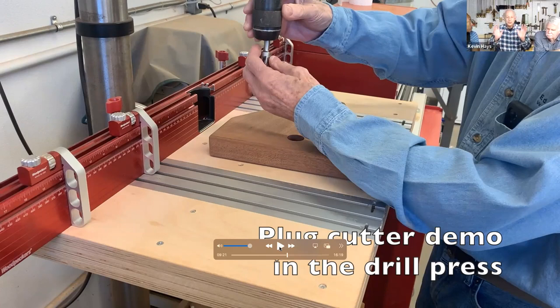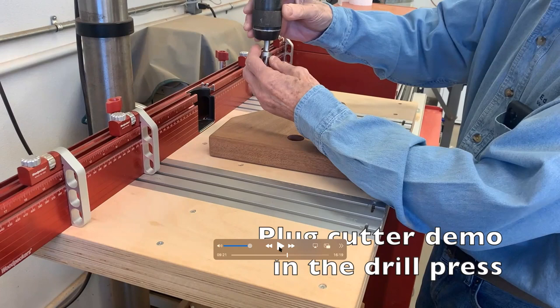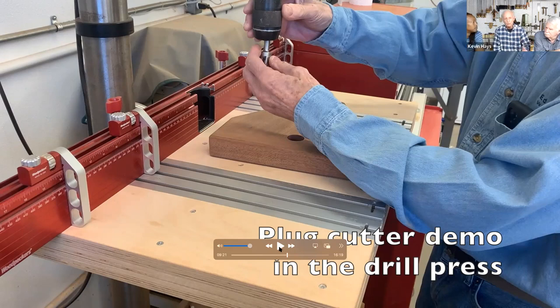Well, here's the solution to the whole problem. Carve out an hour of your time, go out, drill a bunch of holes, get a bunch of different screws, an assortment, and sit there and drive them, and you will get the feel for what we're talking about. Sometimes it's a little overwhelming, with torque settings and screw sizes and all that, but start out with a number 4, number 6, number 8, and go up the line, and you'll get the feel of it. You'll understand that for a number 10, I've got to kick it up to about an 8 torque setting.